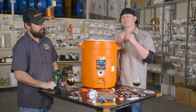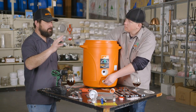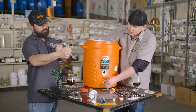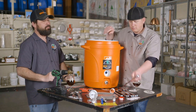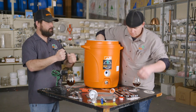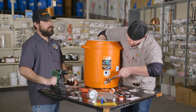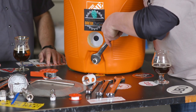With this washer in there it helps apply even pressure to that gasket and allows the nut to spin. You're going to need an inch and a quarter wrench for that big nut on the inside and one inch on the outside — two wrenches, or two crescent wrenches opened up. You don't need an insane amount of torque on these bulkhead fittings, but they do need to be snug and tight. As long as you've got that Teflon tape on there, the gaskets in the right location, and that washer, you'll have a really clean install with no leaks.